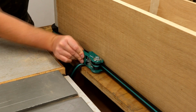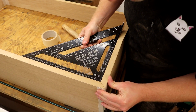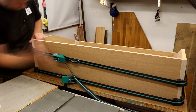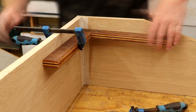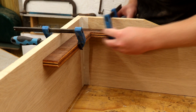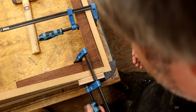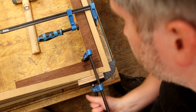I used a speed square just to make sure that the joints were square, and they looked good. However, after tightening the straps some more, I found that it had skewed slightly out of square. So to force the corners back into square, I clamped on some of these clamping squares. Peter Millard has a great video about how to make these. That's where I got the idea from, and I'll link to that in the description box below.